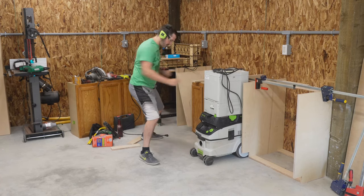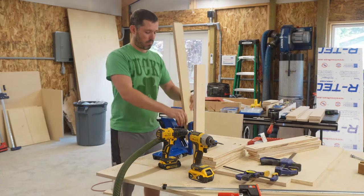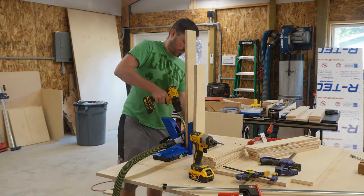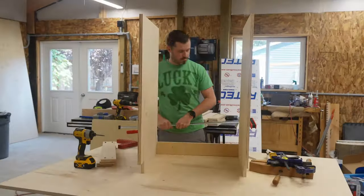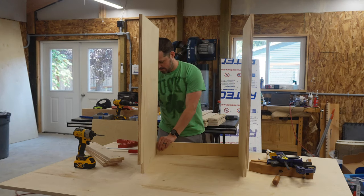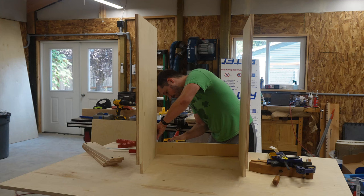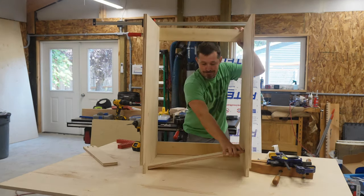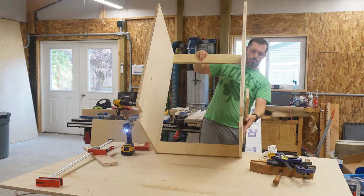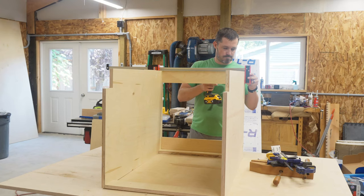With the spacing decided, it was time to start assembling the cabinets — and time for pocket screws. I'm going to spare you watching me drill a hundred holes and cut to assembly, but I was really glad to have this particular Kreg jig for the drilling process. For assembly, it was honestly just a matter of using clamps to hold the stretchers in place while I drove the pocket screws in. The first few times were a little awkward as I figured out the right way to get the clamps in place so that the boards wouldn't shift and the cabinet didn't cave in on itself, but eventually I got the hang of it and batched out the whole set.